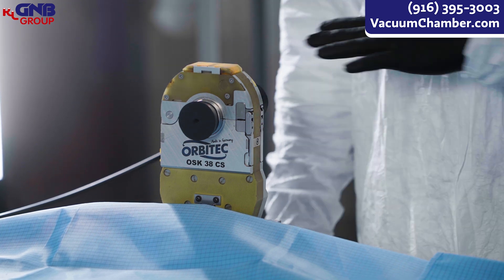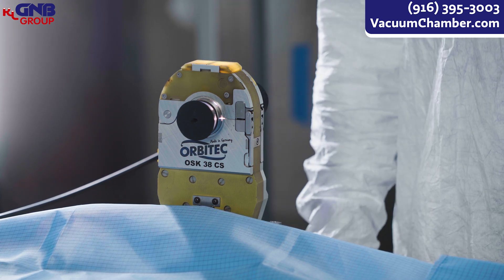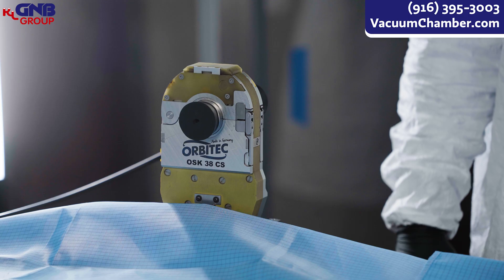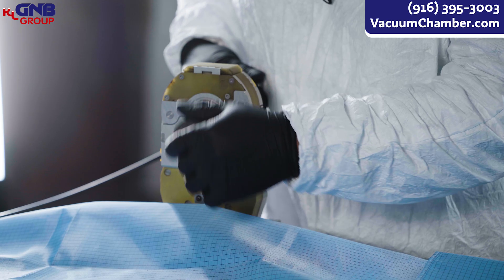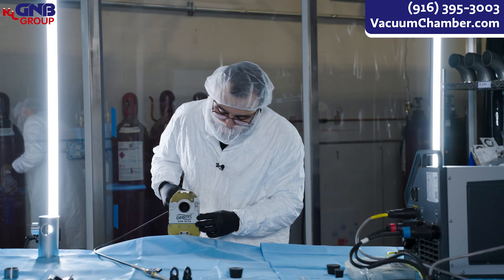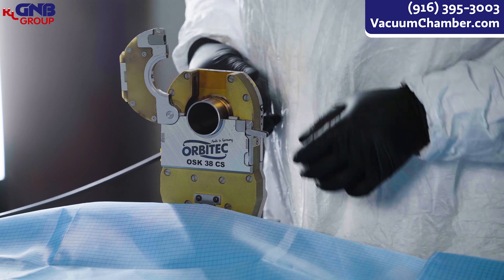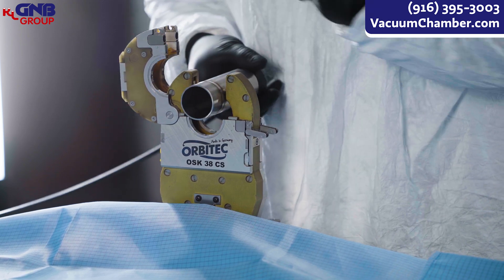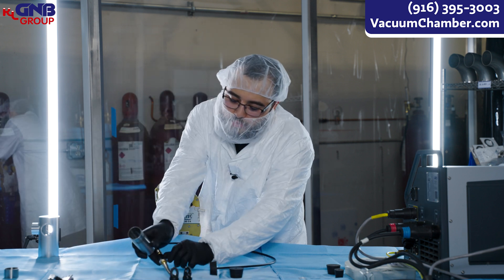You're basically monitoring this whole thing off the screen on the computer. The part ended up finishing, and you just take off this plug — it's going to be hot so you just got to be careful. Take this piece off and take the one in the back off. Take off your purge line and make sure you turn it off so you're not wasting any gas.